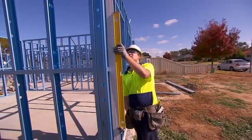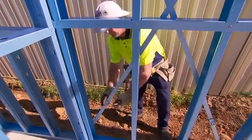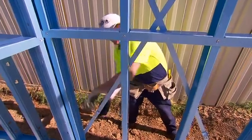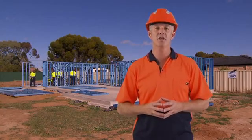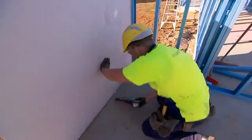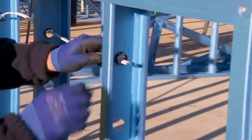Use a plumb bob or level and set the walls to vertical by increasing or decreasing the tension on the diagonal bracing. Ensure bracing straps are tight and screwed to each stud. Having completed the wall frames, proceed with the installation of the next storey floor or roof frame. Aligned service holes make cabling and plumbing easy and straight walls give a great finish to the plasterboard. Follow-on trades will find working with the EnduroWall wall frames a breeze. Install the hardy brace according to the manufacturer's recommendations.